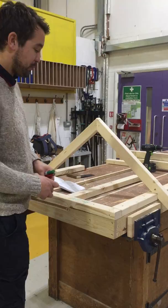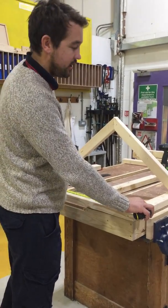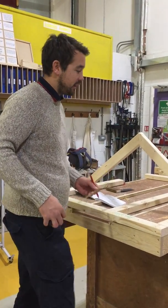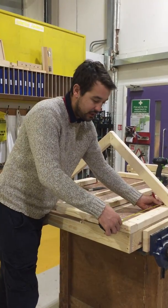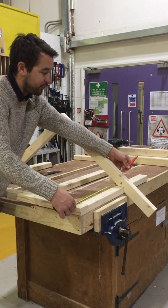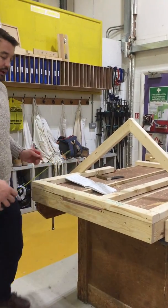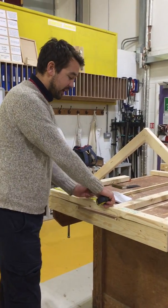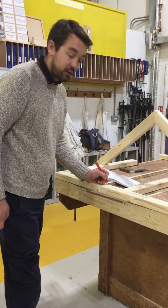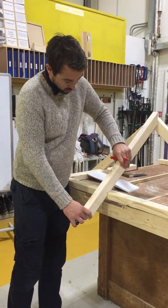To mark the distance back, you've got to measure the span — that's 920mm. Divide that in 2: 920 divided by 2 is 460. I've come back 460 to the centre of this rafter on both sides, then come 460 to the centre here, plus half the thickness of my rafter. So my rafter is going to sit on that line there.